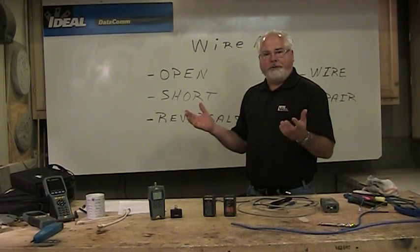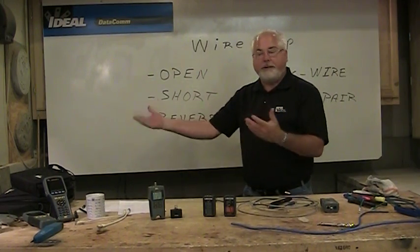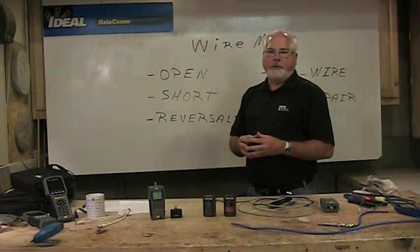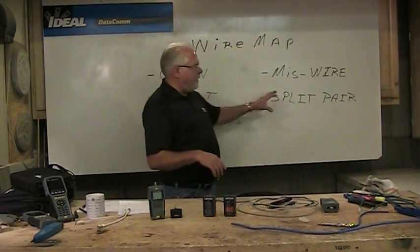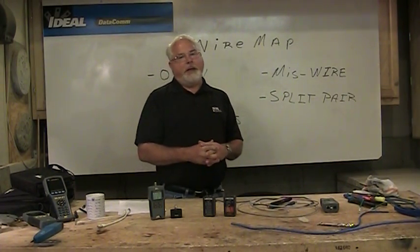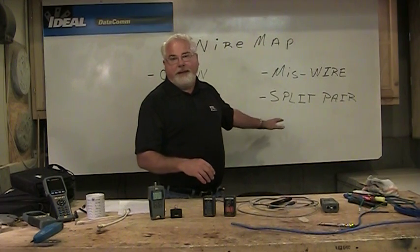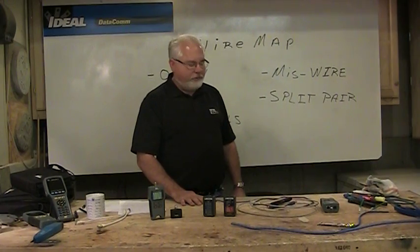Well, a normal tester that's looking for continuity in the cabling would say, hey, is pin 4 hooked to pin 4 and pin 5 to 5? And the tester would say yes. But since those two conductors in that cabling are not twisted together, they can't eliminate noise or crosstalk in a pair. And again, that's a problem we call a split pair. It's interesting, back in the day when 10BASE-T was king, it didn't even notice this as a wiring error. Today, with Fast Ethernet and beyond, 100BASE-T and above, it is a major wiring error. Back in those days, we had to go out and replace a bunch of patch cords that were miswired like that. So we saw stuff like that in the industry.